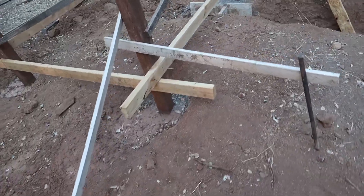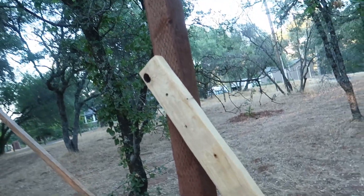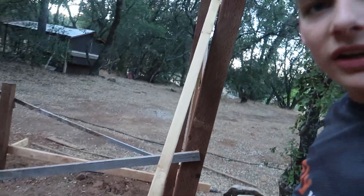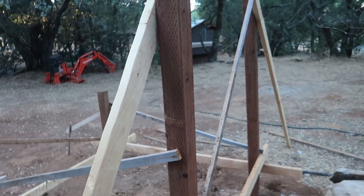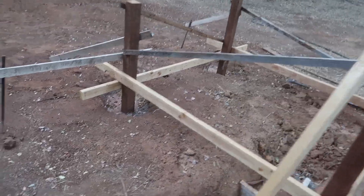The concrete has dried - I used fence post concrete. I have a little post holding it up, but it's wiggling like crazy so it's not as solid as I thought. I'm going to grab a stick, nail it down, and then get the tractor, use a laser level, cut them all nice and level, and take all the bracing off.